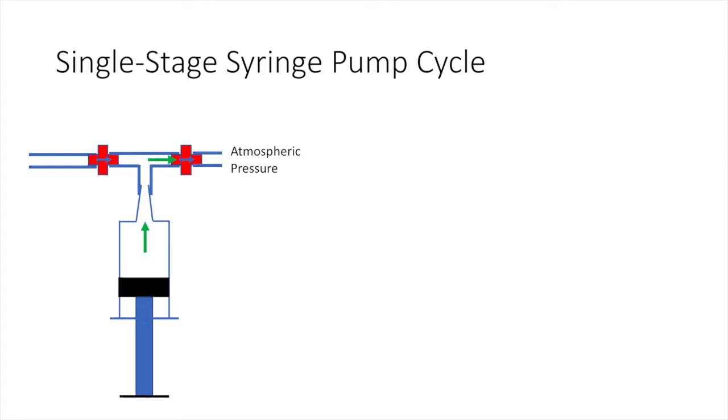As the piston is then pushed back to its starting position, air pressure causes the outgoing check valve to open and let the air from the chamber escape to the atmosphere. However, as we discussed earlier, the difference in pressure inside the syringe chamber and the atmospheric pressure creates a pressure gradient on the outgoing check valve on the right, making it harder and harder to open the valve as the pressure drops in the system.